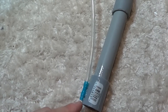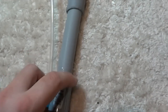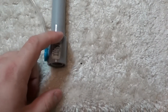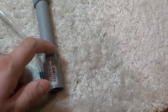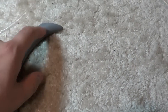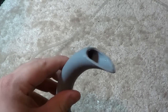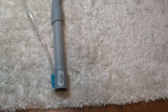The air can't escape the bottom so it has to enter through this side. Here are the pieces of PVC: this is just your simple slip-by-slip connector, this is just a straight piece of tube, and then this is a long elbow. At the top I just cut it at an angle to give a nice spout, so it kind of goes 90 degrees once it gets to the top.